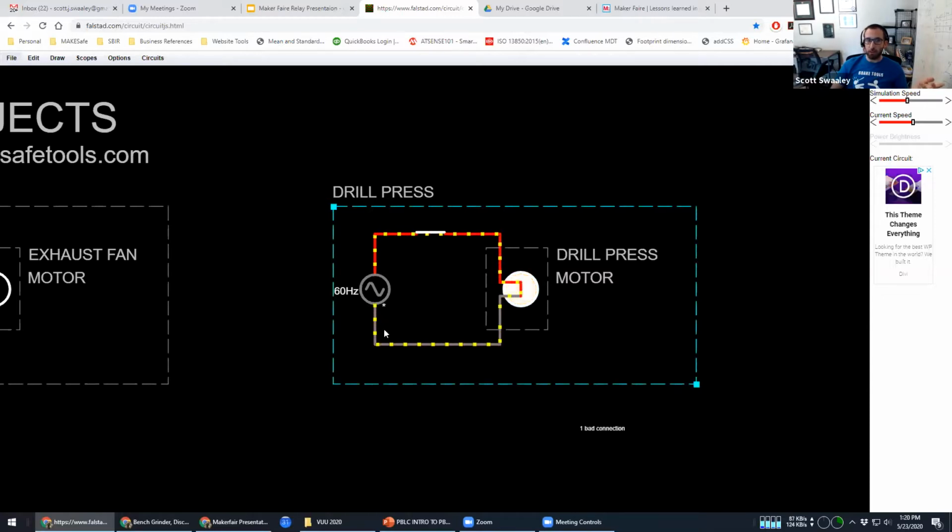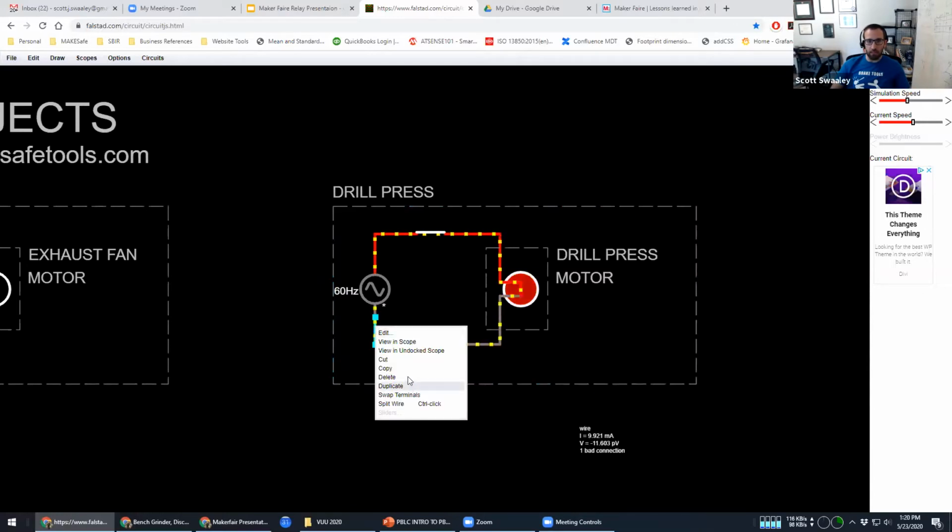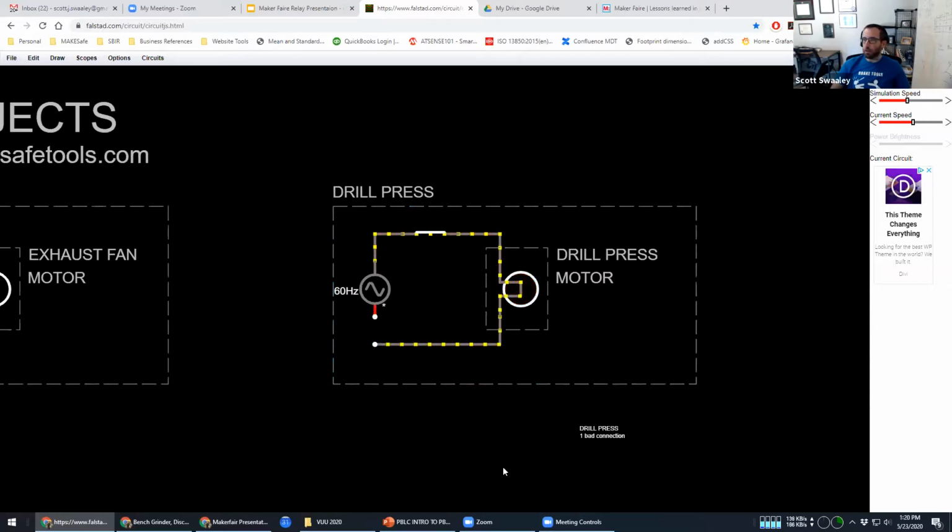So they blow a circuit breaker. Power's disconnected, and they go, oh darn, what happened? And they run off, and someone trips the circuit breaker back on, and power returns. That tool's going to turn back on, right? In the room by itself with hopefully nobody near it.